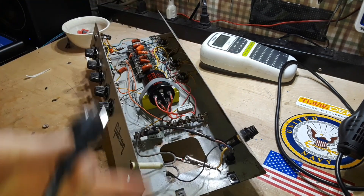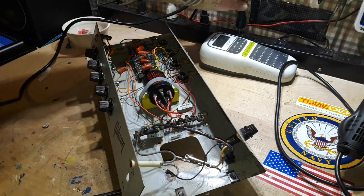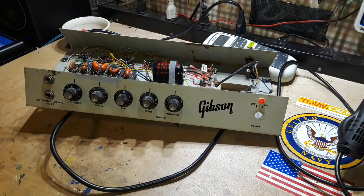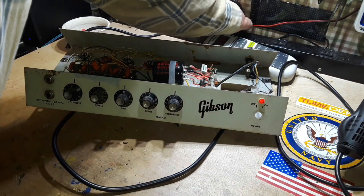This is where the live comes in through the plug, through the fuse, and then it's going to go to the switch and the indicator light. What I want to figure out is if that indicator light is working, so I just wired it in. Yes — we actually have something here that works. The indicator. Great. That's one thing off the list.